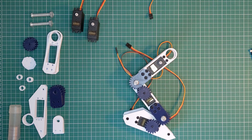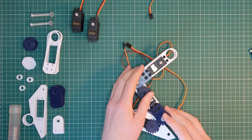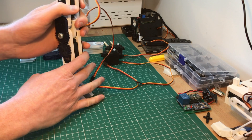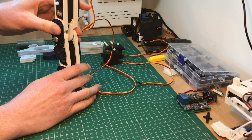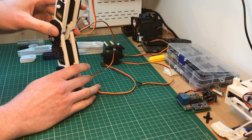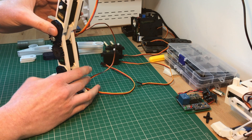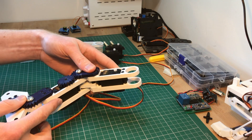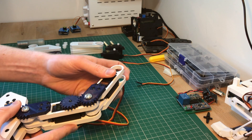Since we're supporting the weight on both legs you can double that, but it means we can only carry just over a kilogram before we hit that limit. It's more complicated than that — if the weight is distributed more over the centre of the servo then the torque required is less, something called radial distance — but this is planning for the most extreme cases. I'll include a link in the description that describes this calculation in more detail.